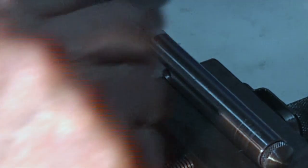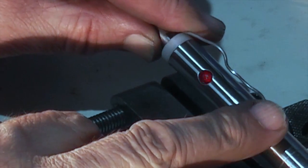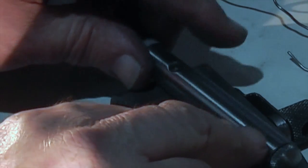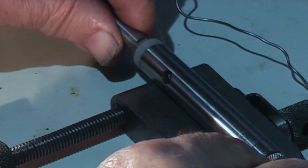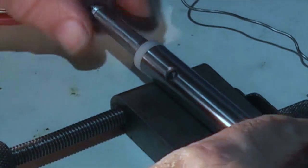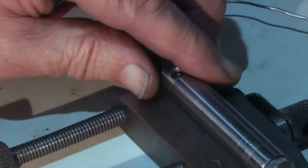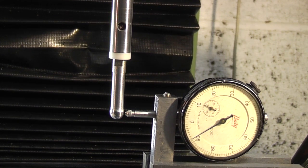To test it, all you need to do is put the wire between the two — the light works. That's the finished part. If you get any problems with the electric contacts not working properly you can put a stronger spring in so it pushes on the brass parts inside. That's it — so let's go and put it on the milling machine. I've put the dial indicator in the milling machine; as soon as the dial indicator touches, the light should come on.